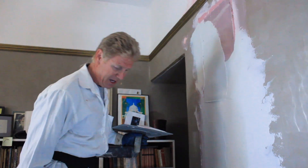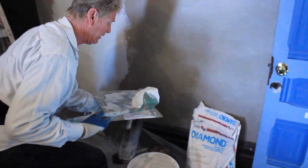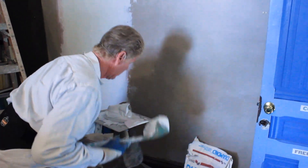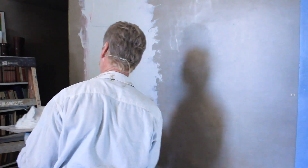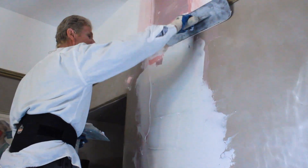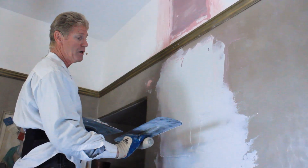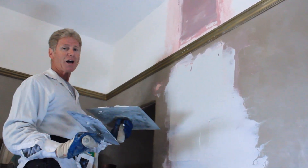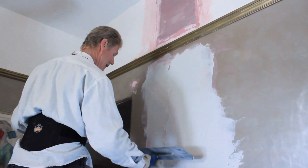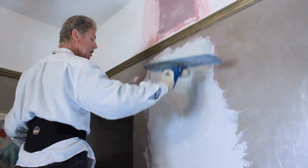Can you go an inch or two? Yeah, I've done it thousands of times. I'll be finishing a house, see a bunch of holes anywhere between one to two inches deep, and I'll just fill it with this. When this sets, it sets. As soon as I took my first hawkful out of the bucket, I've got a half hour to use it — apply it, then it's going to get hard. When it gets hard, I'm going to bring it back to life, get some of the holidays out of it, and make sure it's true and plumb.